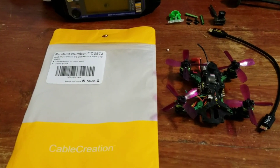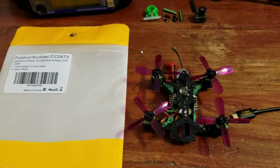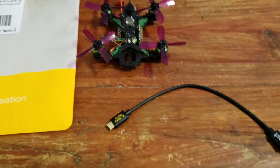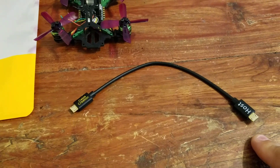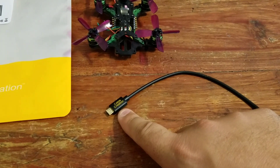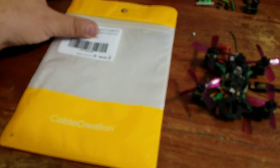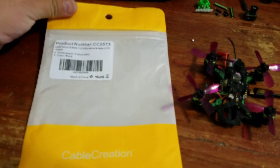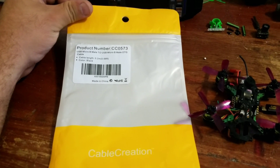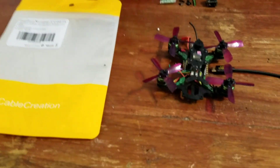You can do it with an app called SpeedyB, but you need a very specific cable if you're not going to buy the Bluetooth connection that comes with it. This cable — I had to track it down myself. The part that plugs into your phone hosts SpeedyB Betaflight from your device, and this part plugs into the quad itself. This cable cost about $7.49, and it's a USB Micro-B male to USB Micro-B male OTG cable. I will put a purchase link for it below.